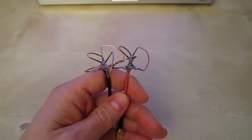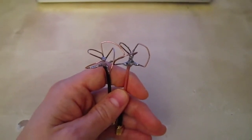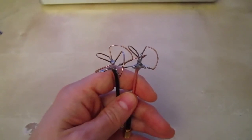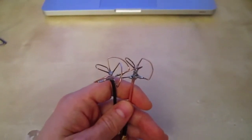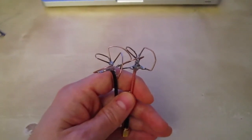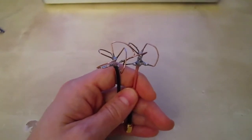I've been trying a lot of different antenna combinations with my 5.8 gigahertz FPV video system and I haven't been happy with the results. I've been trying just some dipole antennas, and I just recently tried a patch antenna — an 8 dBi patch — and I was not happy with the results. It didn't have much distance, added a lot of interference, and I lost the omnidirectional capability of other antennas.